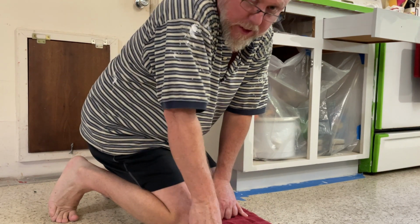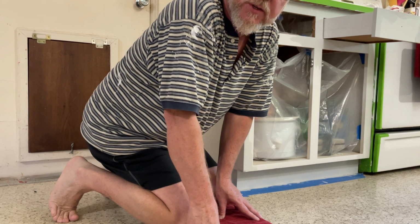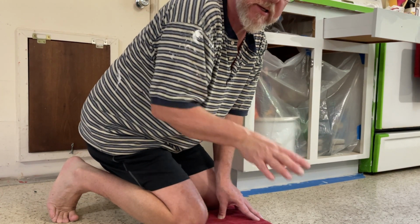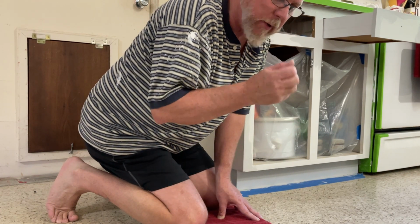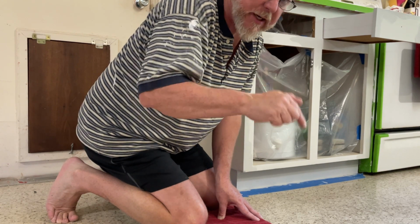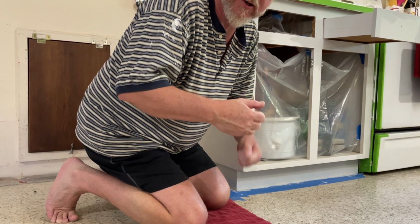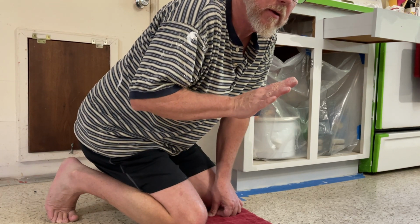Another pro tip, I'm not a pro: when you're cleaning brushes with oil-based paint using mineral spirits, have two containers. Have a dirty container of mineral spirits and a clean container of mineral spirits. So just like with washing, right? When that brush is fully loaded, you get it as dry as you can, then put it in the dirty bin. Rinse it out as much as possible. Now, actually squeeze it with a rag to make sure you get as much of it out. Then put it into the clean one, and it will clean up faster.